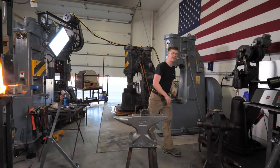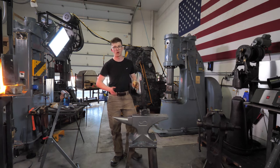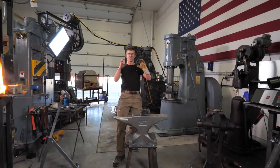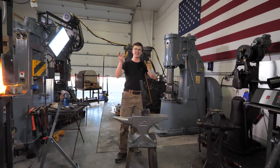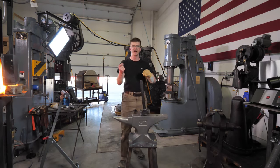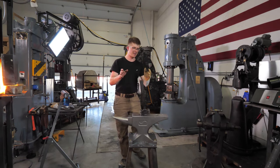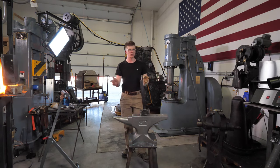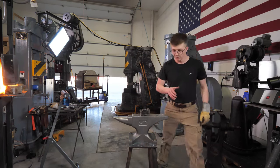So, in case you're not familiar, because I also have been unfamiliar with these things before, the ram itself isn't just a piece of cast and machined steel running up in there. Well, it is, but there are these piston rings, which are these rings of cast iron, which are the wearing part, which you can replace. They stick up off the edge of the ram, and that's what rides on it. And if they didn't seal well, that could be how it's leaking.